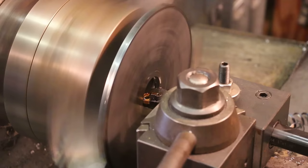I had a list there that I worked off of. This was back before we had spreadsheets and computers, so I did it all by hand basically and wrote it all out, and I would dial that in on the rotary table and drill the hole, dial the next one, drill the hole, dial the next one, drill the hole, all the way around. And I did the whole hole patterns, and it was a very tedious job, as you can imagine.